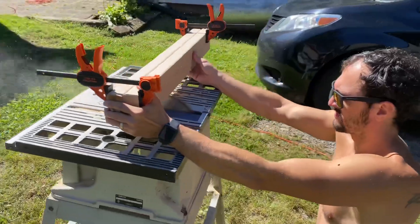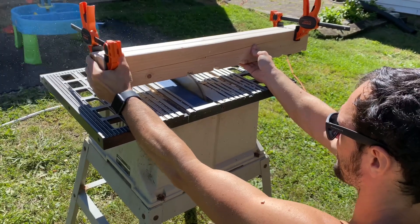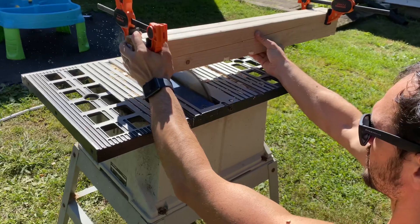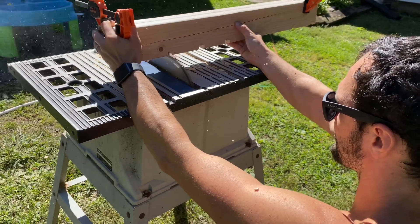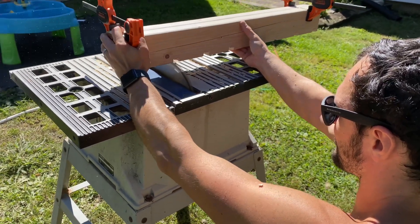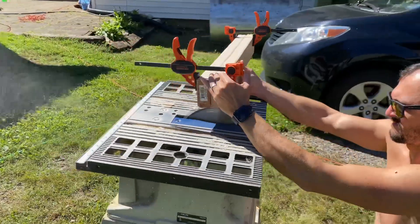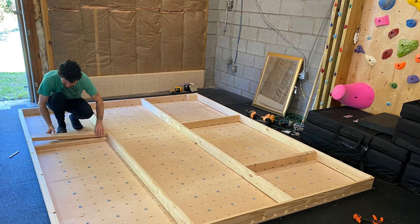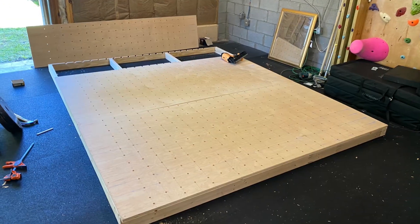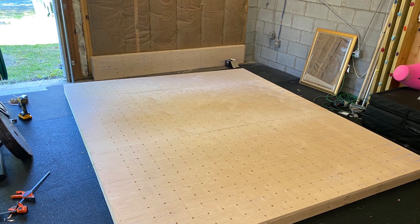You've got to find a way to create these little tunnels for the LEDs to fit through — the LED strings have to go under the horizontal supports, not over, as there won't be room otherwise. I made it through this phase unscathed — no lost fingers, no misfires, which is awesome. Definitely the sketchiest part of the build though. Once those are up, you can see the tunnels underneath the horizontal supports. Once the horizontal supports are in place, we put the face on. Use screws, not a nail gun — it's worth the extra time.